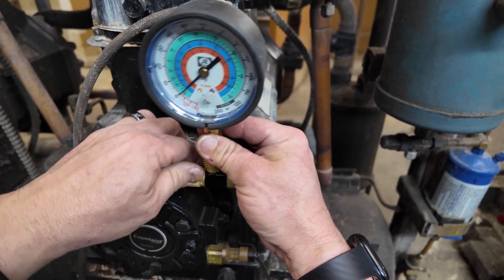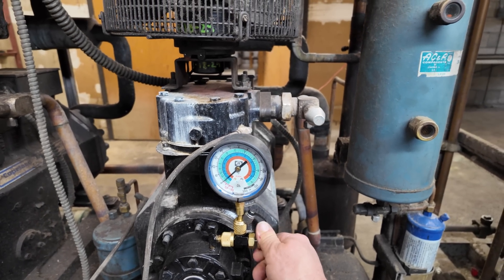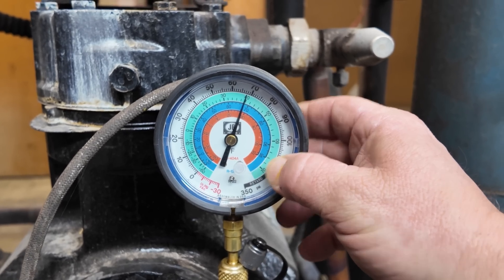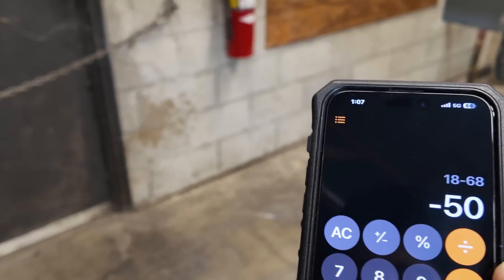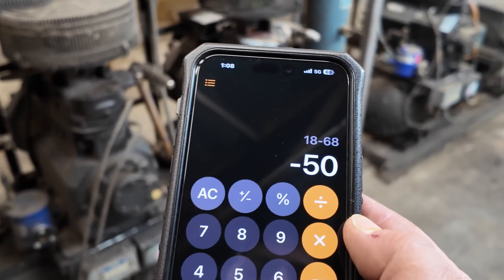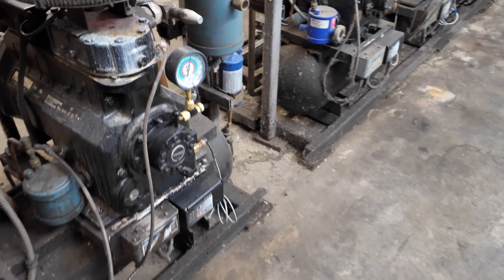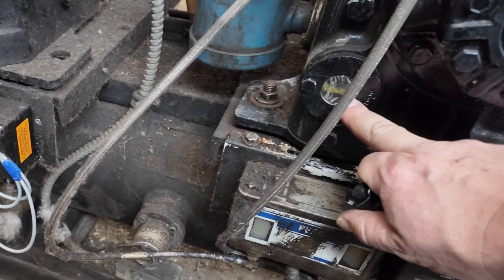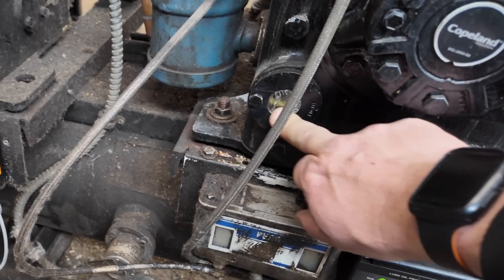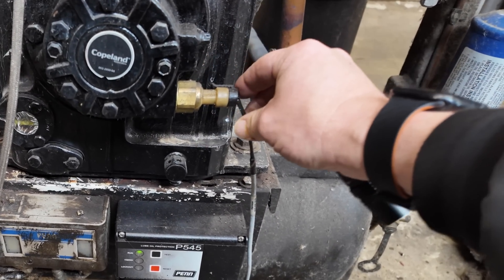So let's go ahead and screw this on — we've got it from crack strength outwards so that it's not going to depress. There we go. Now let's go ahead and screw this in. Look at that — actuate a little bit. We're at 68 pounds. Let's see what our suction pressure is — we've got 17.9. We're at around 50 pounds actual differential there. You only need 5 or 10 pounds on average, but you should average usually 40 to 45. So we know we've got plenty there. The oil level right there is at the halfway mark. The glass got tightened a little too much, cracked — it's a darker color but it's not dark black.